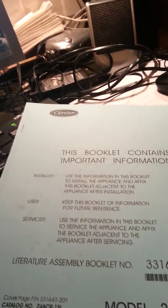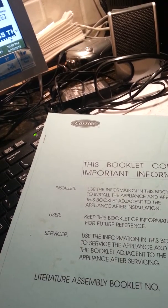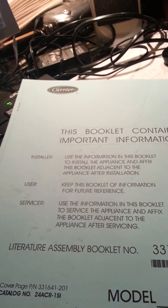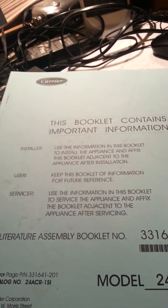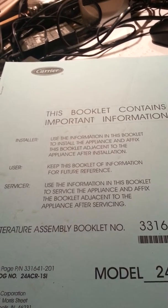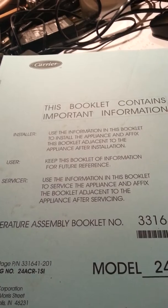I went to fire up my dual carrier unit air conditioners, and one of my compressors did not come on. I couldn't figure out what would make that happen. I spoke to a friend who's an electrician, and he told me to go manually push the contactor — a solenoid at the compressor that engages the high voltage to the compressor. I did that, pressed the contactor, and the compressor worked fine, but it wasn't engaging on its own. It wasn't getting the 24 volts that it should have been getting.